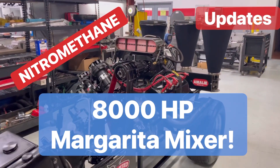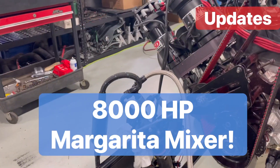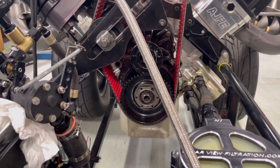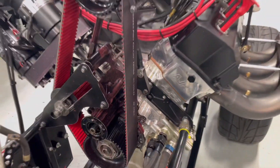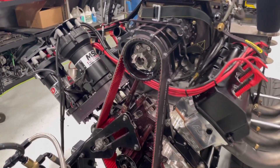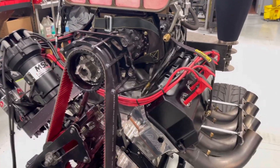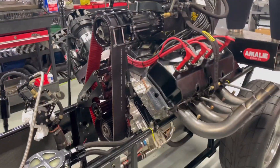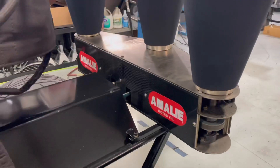It's time to take the nitro blender and make it a little bit safer. What we're going to work on today is making sure that this belt can't come over and knock these oil lines off. Eventually we're also going to run the fuel lines down in that same area, but we want them protected. When you're whacking the gas on this thing and running one of these belts, you take a chance of breaking it — the last thing you want is the belt flying off, knocking the oil lines off, and causing an oil-down in somebody's backyard.